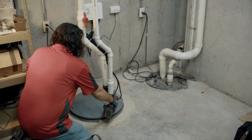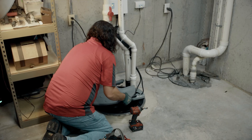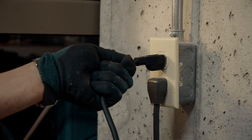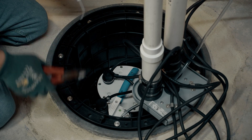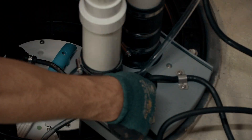Installation is a solid 9 out of 10. The best thing about this system was dropping it in and bolting it down. Installation was a breeze. Now we're going to check on serviceability. Take the lid off. We're going to run the pump to clear the pit. Unplugging the unit, unplugging the alarm, silence the alarm. Now we're ready to cut these cables — we're going to slide as much cable as we need back through the grommet so we can pull the pump out.